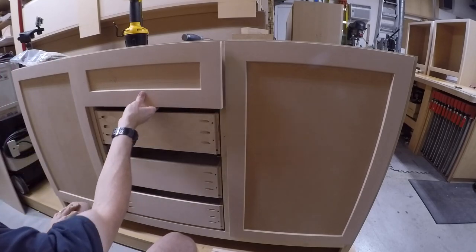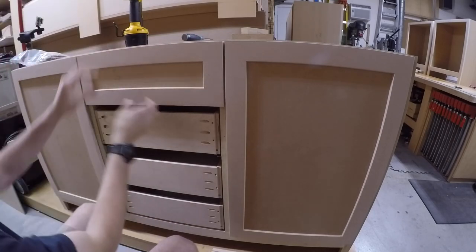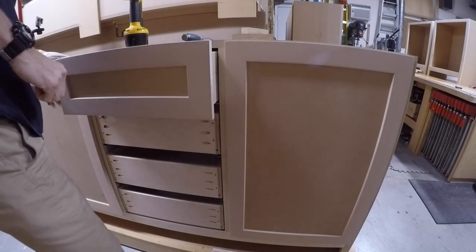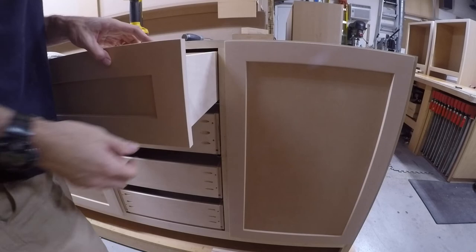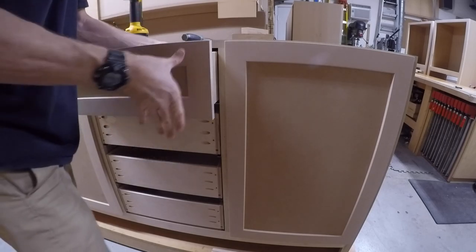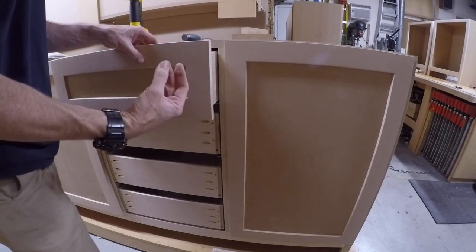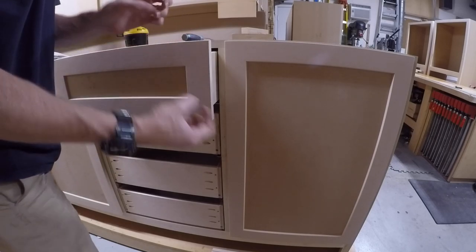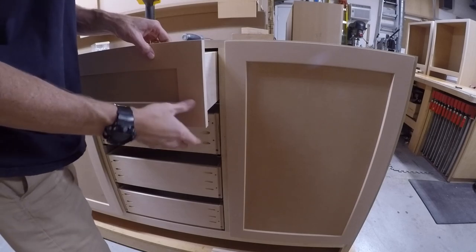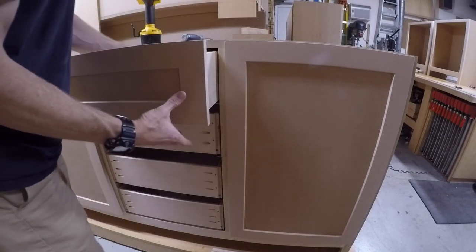I'm going to go ahead and open this up and then shut it and see where it lies. Yeah, that thing is right on the line, perfect. So this is what I was saying, it's nice to have a tight drawer front right there. So when the drawer boxes are open, when they're flush with the opening or really close to it, I can get a nice tight fit to the drawer box. But if it's too far in, there's a gap, so it's hard. The nail goes in and there's a space there, then it's hard to draw it tight without shifting the drawer front. So, all right, since this one nail is right there, I'm going to go ahead and just hold this while I drive it. Give it a little support.